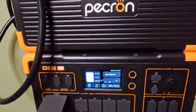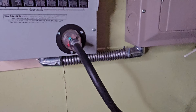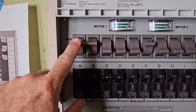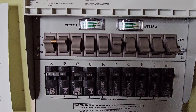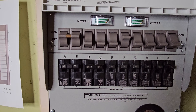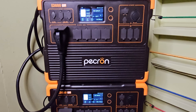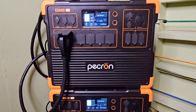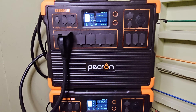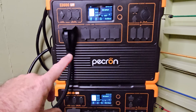The second line is not being taxed at all. That's because I've only turned on my water heater — which will tax both lines — and my furnace on the manual transfer switch. So let's see if we can get the electric water heater to kick on. It should pull somewhere around 5,500 watts and it'll divide that evenly between both units.